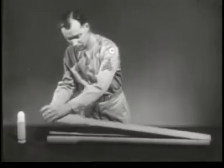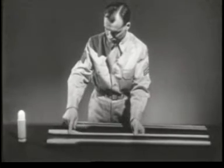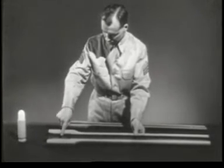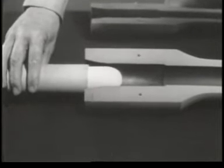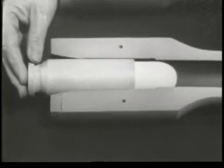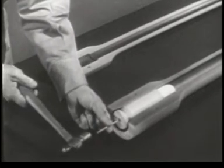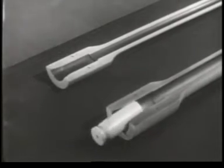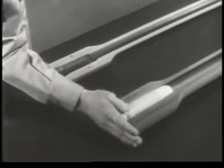We'll start with a barrel. Removing the top half of the barrel, we can see inside. In the breech end is the chamber. This is where the cartridge fits and where the explosion occurs. Placing the cartridge in the chamber is known as chambering. A sharp tap on the primer would explode the powder charge and drive the bullet out. The same explosion would also drive the case backward out of the chamber.